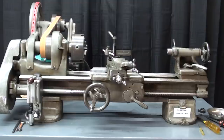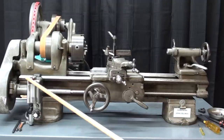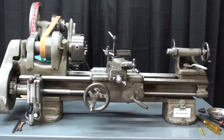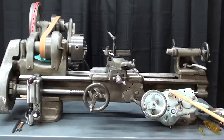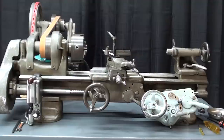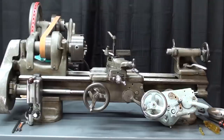This is the little 9-inch lathe that was given to me by John Collings down in Florida, and it is a Model C. That was the entry-level model without a quick-change gearbox, and it has a simplified apron here without an automatic cross-feed. In previous videos, I've already reworked this lathe and converted it from a C to a B with a different apron. This is the Model C apron, and this is the apron used on both the Models A and B in the 9-inch size. In the second video in this series, I will convert it back to a Model AB with this apron.